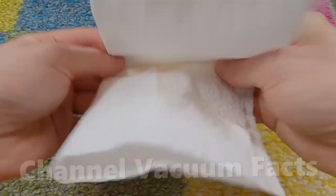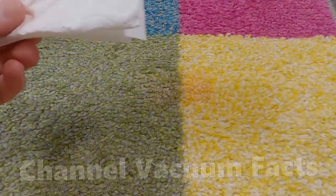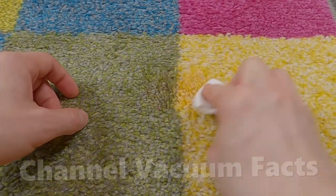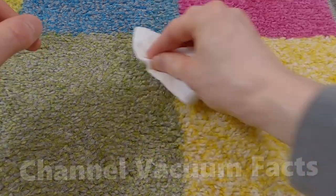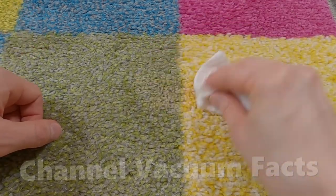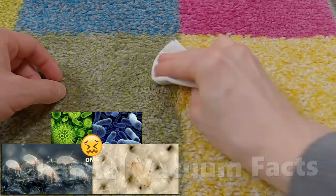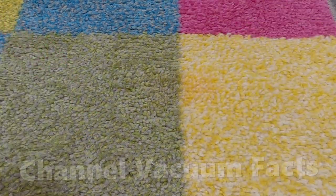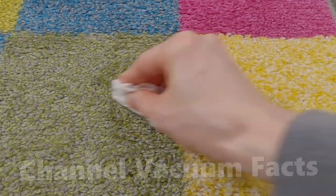This step-by-step approach is a smart way to remove heavy messes because it controls the amount of liquid in the carpet so it doesn't get too wet and doesn't drip down the fibres to the base of the carpet where you'll really struggle to get it, especially for thick carpets. These spray solvents dry much faster than water and don't allow mould, bacteria and mites to grow. Really bad stains can take a few minutes of blotting to get it all out, but it's much quicker than any other method and gets better results.